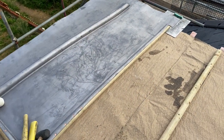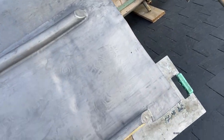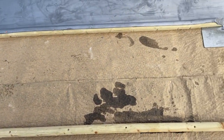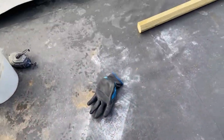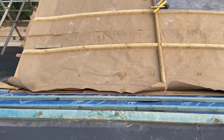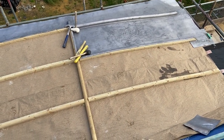Okay, so I'm just in the process now of putting these bays on. As you can see, I've got this one on there already. That's gone over quite nicely, to be honest with you. And I found the easiest way of doing this, because it's not much of a curve. It is pretty flat. There's a slight curve to it, but it's not too bad. So what I've done is one I've just knocked up, ready to go in. When you knock up your overcloak, just fold it halfway around the wood roll. And then when you sit that on, you'll find it pretty much goes to the curve. So I'm going to carry on now, getting all those bays through.